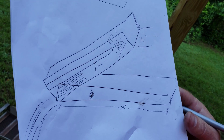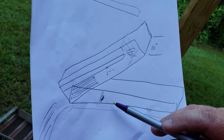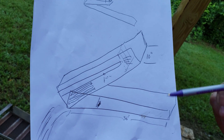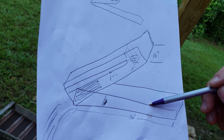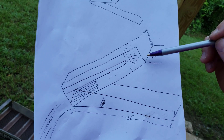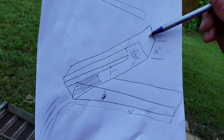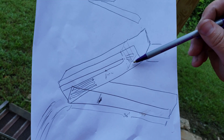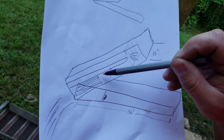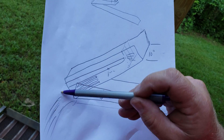When we started this project today, we made a small sketch of what we plan on doing. This is our 36 inch Keen sluice box that we already have, and this is the high banker on top that we plan on mounting on it. It's going to be 10 inches wide, the same as the Keen sluice box. It's going to have a spray bar in the middle, grizzlies on the top, and classifying rods on the bottom. The material will be fed in, get washed thoroughly, fall through a secondary spray bar in the middle, and all the small material will go through the classifying rods while the big rocks fall off the end.